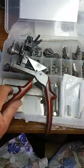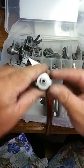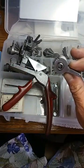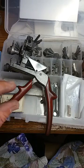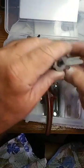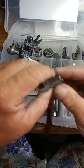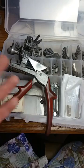As a matter of fact, we have a lot of the carriages here for Ford. This is for the early Ford. They had the 5-pin, the single-sided key, then a double-sided key, and then it went over to the 8-cut and then the 10-cut. And then here we go. We got another cam here, DC1. This DC1 handles the old Fiats, Ferrari, stuff like that. So you won't need a code machine. You would actually cut it right here.